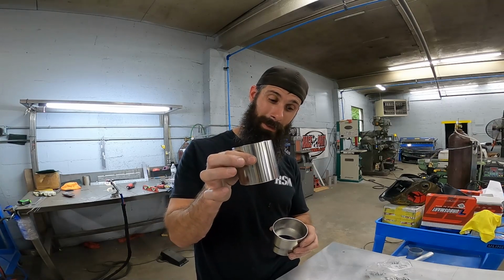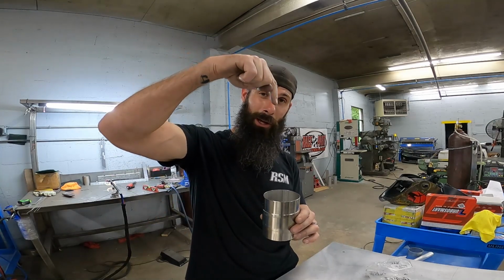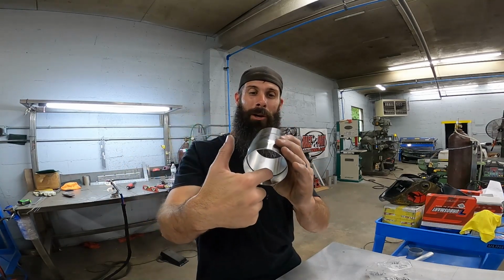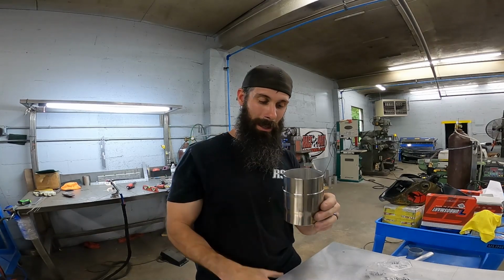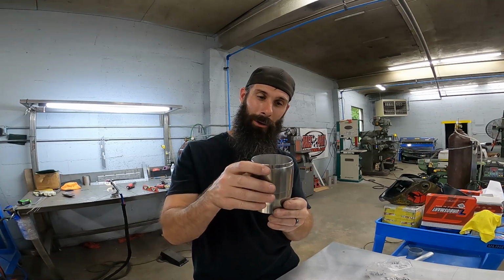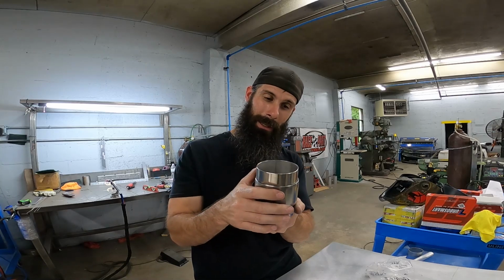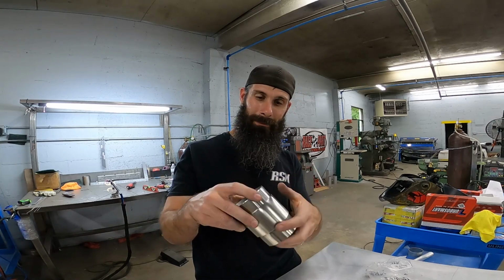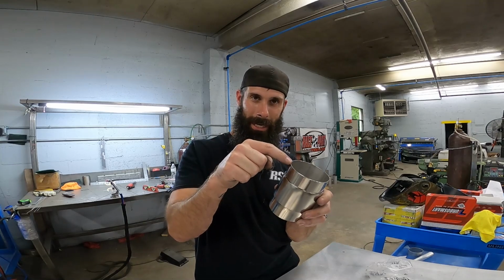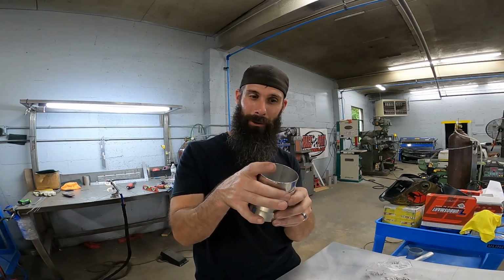So, small piece, it's your bigger piece that's swedged out. Drop the smaller piece in. Exhaust needs to flow starting at the smaller piece and coming out here, because there's your lip. You don't want the exhaust to try to hit that lip on the inside. Then you're going to want to drop your collar down over the big piece. This will make it tight. So when you weld it, you're going to be welding this side, and the part that's pinched down on your collar.